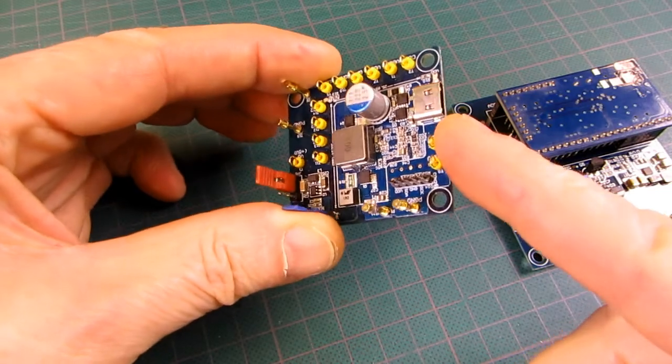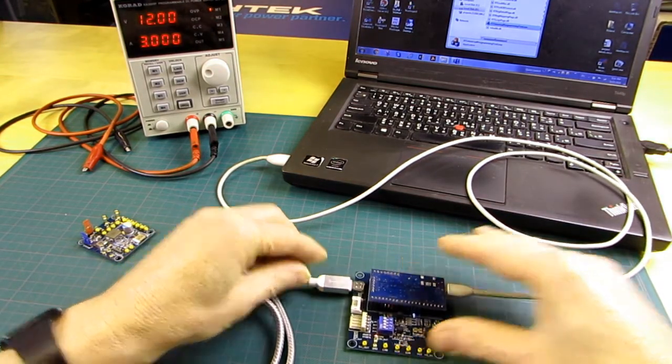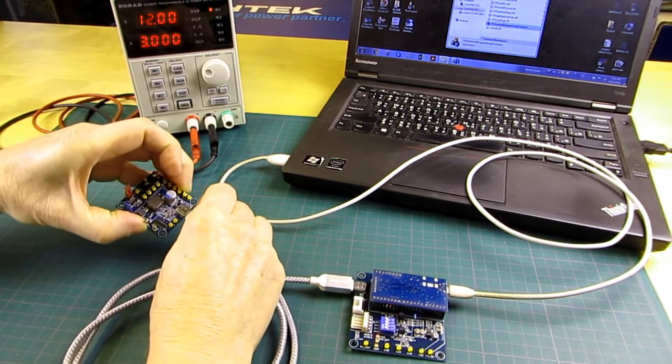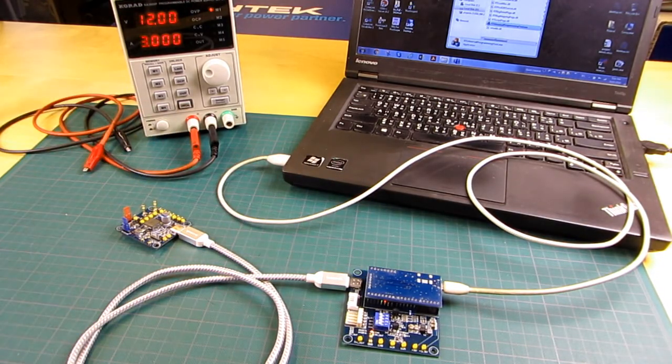You can also reprogram the MTP via the Type-C connector, which may be more convenient for online firmware updating in the field. Let's program the board back to the 60W firmware version. In this case you connect the firmware update fixture Type-C bus to the charger application Type-C bus. The programming will now go via the D-plus and D-minus lines, which are also connected to the RTQ7880 slave I2C bus.